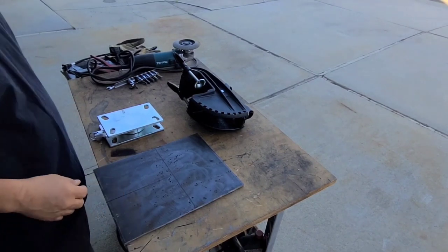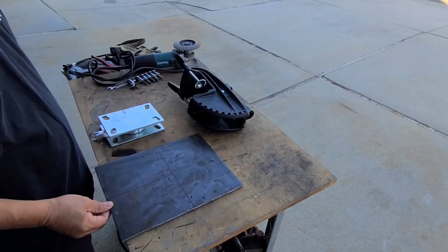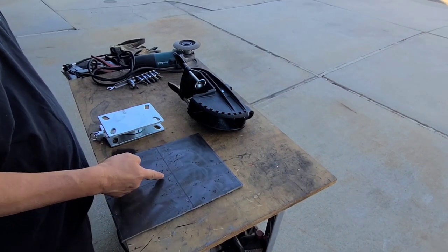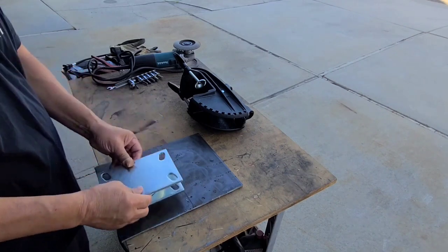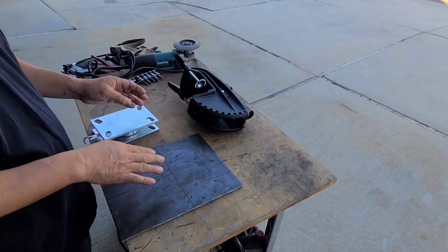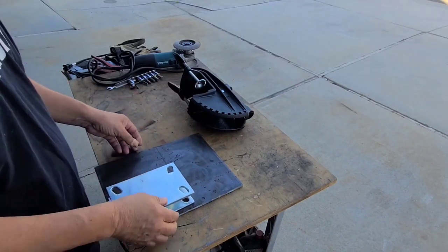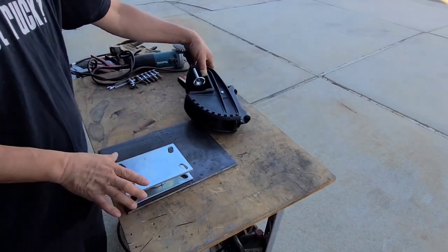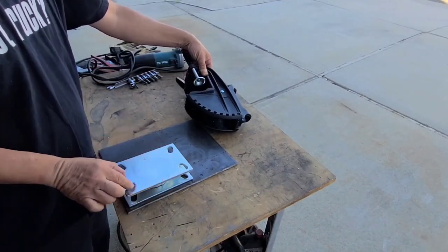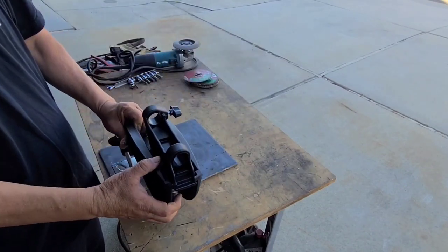Here are the parts I have so far for this mounting system. I got this plate, about a quarter inch thick steel. I'm going to cut it in half and grind this area right here so this can rest on it. It's going to be an angle plate that bolts onto my Versatrac, and then I'll have a square steel pipe that's going to be welded or bolted onto this plate, and this is going to clamp onto this.